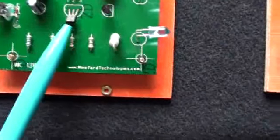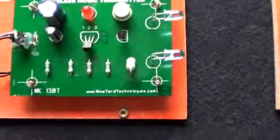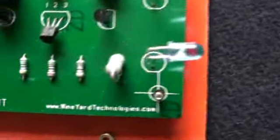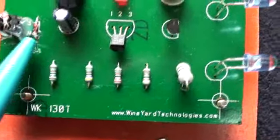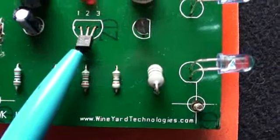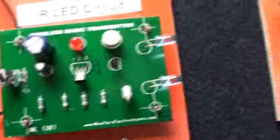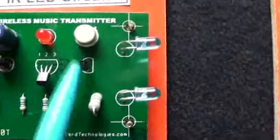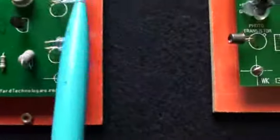The basic component is the Melody Generator — this is the UM66. This IC needs 3.3 volts, but here we are getting 9 volts. So that is the reason we are using a Zener Diode — a 3.3-volt Zener Diode — which provides the sufficient power supply of 3.3 volts to the UM66 IC. The remaining two transistor pair — a Darlington Pair — works with 9-volt power supply, and the output is given to the IR LED.